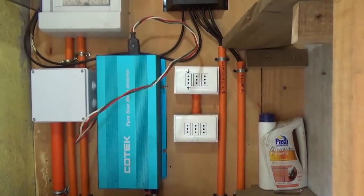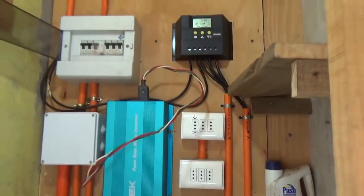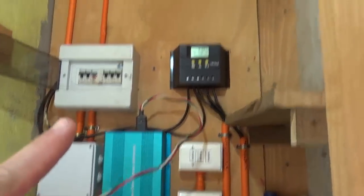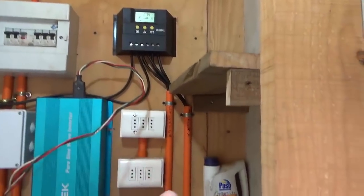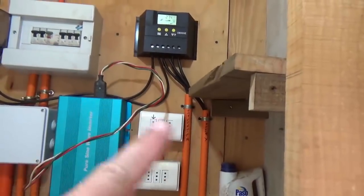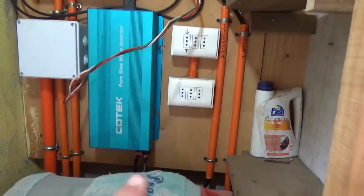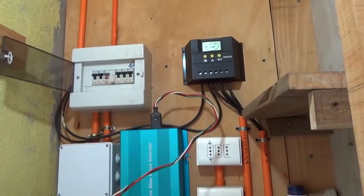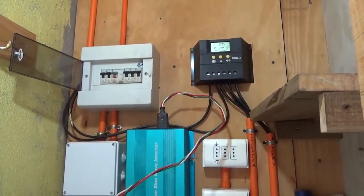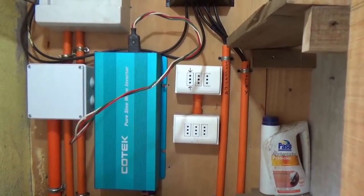The reason is, what's missing? What's wrong with this picture? Okay, well, we got breakers there, but look, there's no disconnect from the solar panels up above. There's no disconnect for the batteries. There's no DC fuses, and there's no disconnect from here over to the house other than the breakers. And the breakers are okay, but if I get a back feed through that line, it toasts that immediately, which is exactly what happened with my 2000 watt inverter, pretty sure.